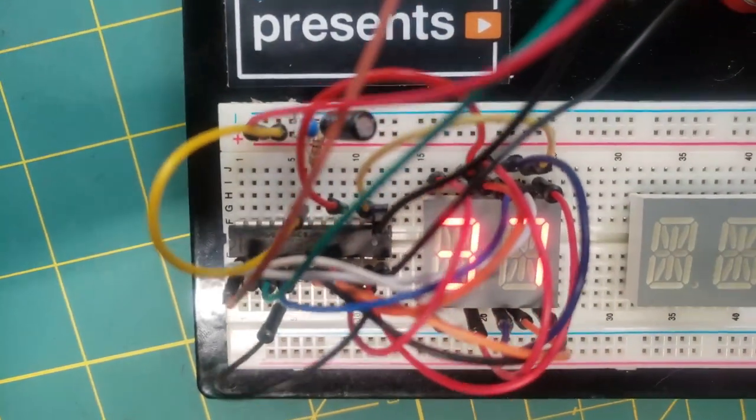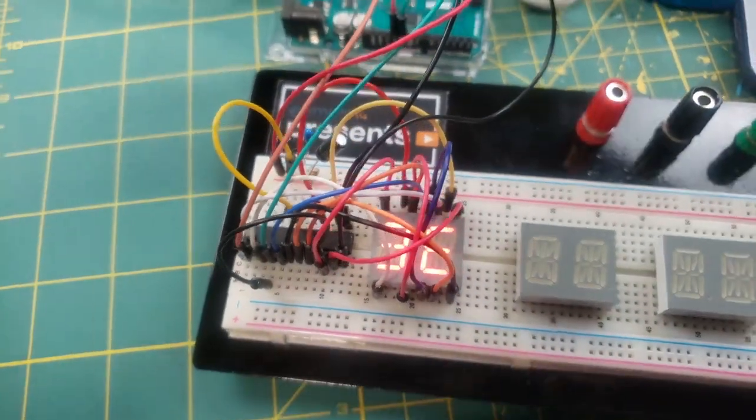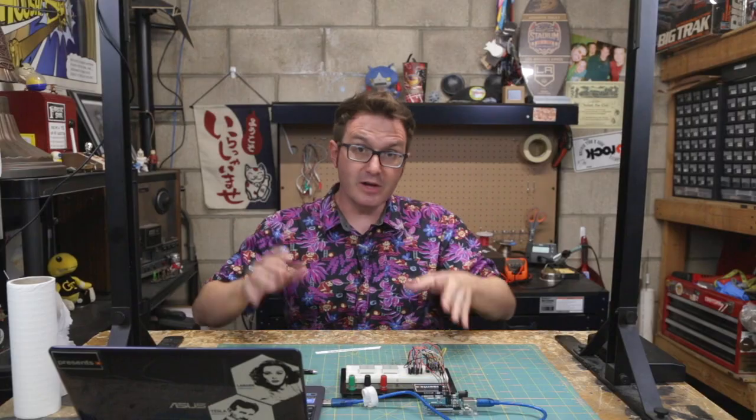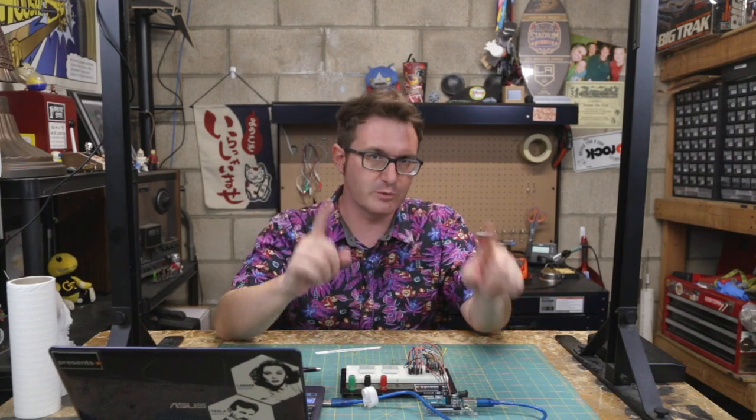Here is our simple little hexadecimal counter — it just rolls through each of the numbers and counts up to 255, which is FF in hexadecimal. After that it kind of breaks because I didn't really do anything after that — I just wanted to demo it and show that it actually works. So that is a common anode 14-segment display driven by a common cathode 7219 off of an Arduino. The cool thing is it only uses three pins, so I've got a lot of room for expansion in the rest of this project.